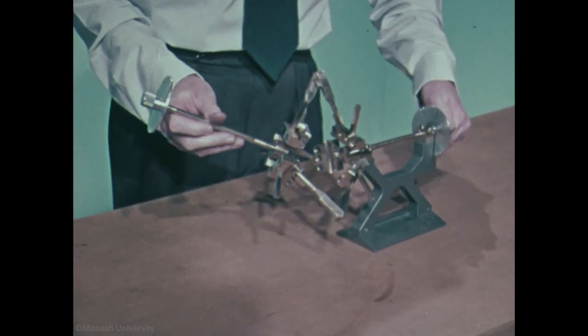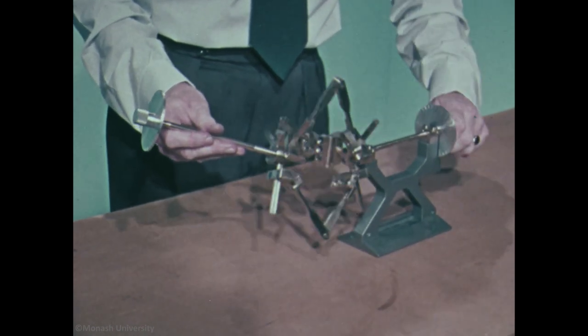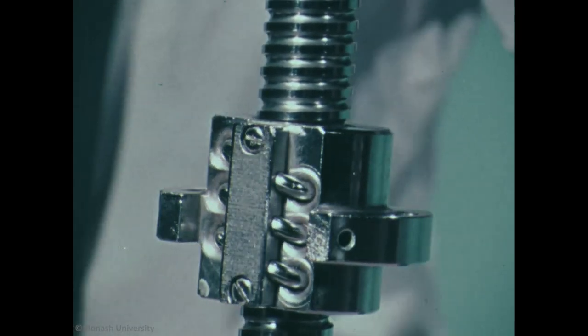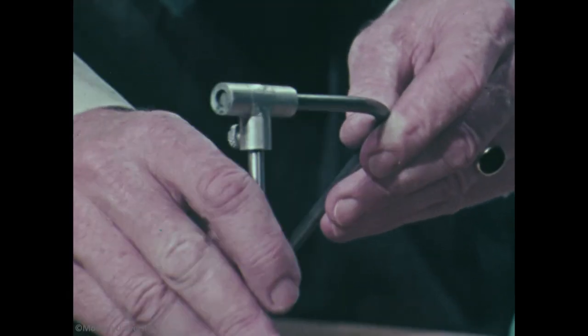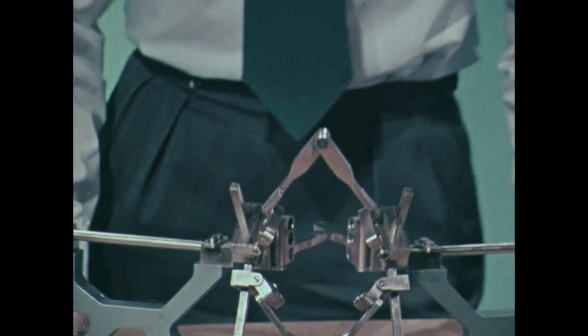The theory reveals that there are many other ways of disposing these five freedoms in each connecting chain. For instance, the hinges needn't be successively at right angles, so long as one side is always symmetrical with the other side. One can even replace simple hinges with symmetrically disposed screw-nut joints. One might make use of joints that have two degrees of freedom — for instance, joints permitting rotation as well as axial translation, usually called cylindrical joints. But symmetry remains an essential ingredient. So the general theory alerts one to other inadmissible or unfavorable proportions or unsuitable forms of joint.